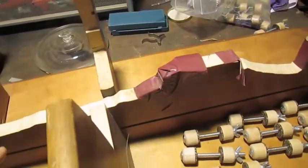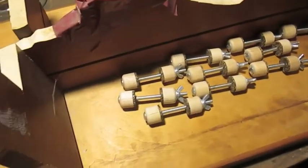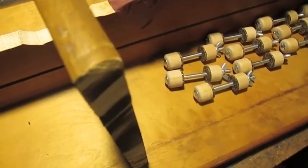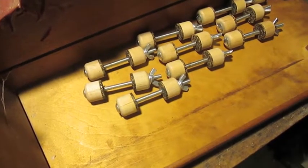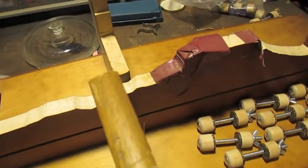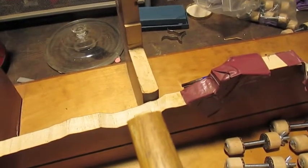Now all together, from the moment we take it out of the heat box until we put it on the frame, put the glue on, put the top on, put 10 screws on first before we put all the screws. One over here, two over here, two over here, two over here, two in the middle, two over here on the upper bout. We put those 10 on first. That should all be done in about 1 minute while the wood is still warm.